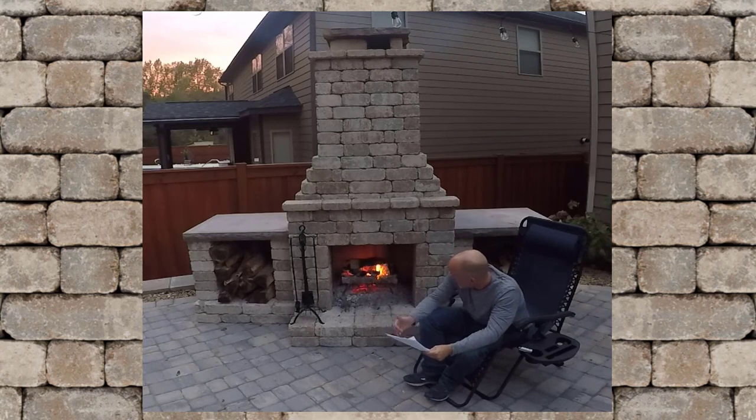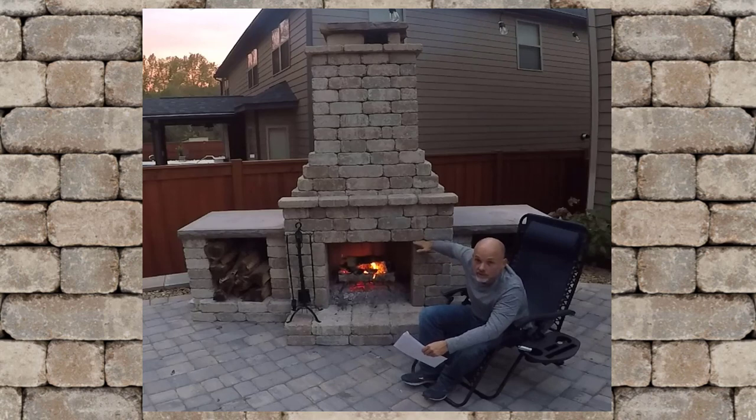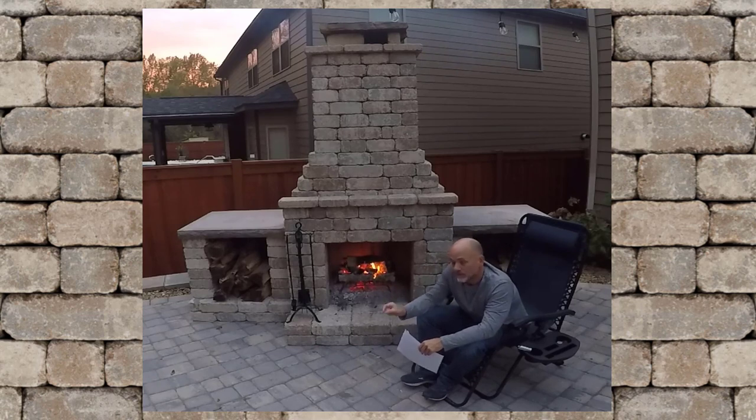I had to trim a couple of my fire brick. The fire brick along the back wall is a constrained dimension. As you saw in the video, I built to about here and then got a call to go play golf. So I went and played golf. When I got back, the next step was going to be fire brick. All this had set, and when I went to put the fire brick in, I was about a quarter inch off. My space was too small, which is no big deal. Brick blades for your circular saw are cheap. I think I got mine for like $4 for my 12 inch compound miter saw. Put it on there and cut them, no big deal. But just be aware of that.